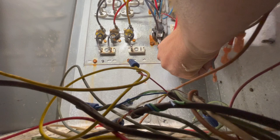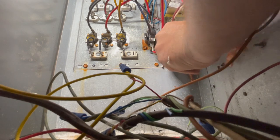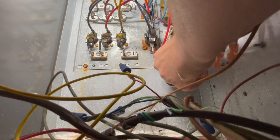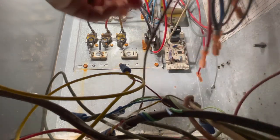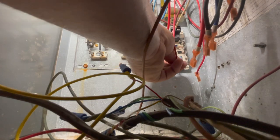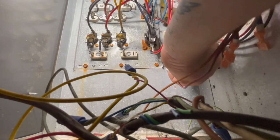And it'll fit just like so. Well, it's supposed to. I can smell the smoke from that other one. There it is. Now she's in there. Okay. So red from the transformer goes to X-former, which is transformer. And then red from the field connection goes to regular R. And then we have common from the transformer, which will go to X-former C.